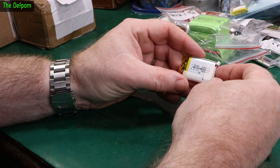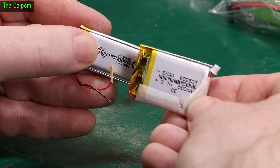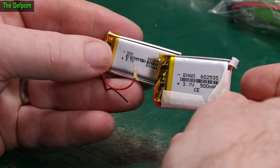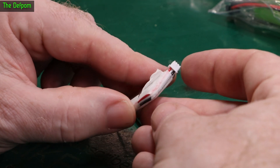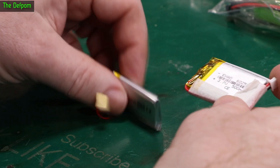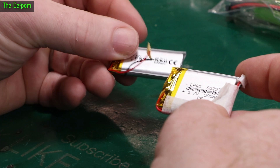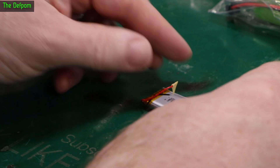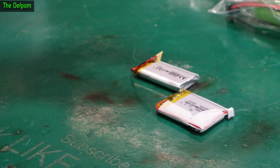There's another battery — also 500 mAh, but a different style and different size. This one's got the plug on it. So the first one has dimensions 60 by 20 by 40, and this one is 60 by 25 by 35 — different dimensions. It's good to see which one will fit best in the unit. I actually have two dash cams which are exactly the same. The other one hasn't died yet, but I'm thinking if one is gone, the other could be soon since they're the same age. This one with the plug may be suitable anyway — I may be able to just plug it straight in or adapt it. The other one I'll have to solder the wires onto the existing wiring. But this one has the thermistor connection, which is the preference. So this is the better one to use, but I've got both in case I couldn't get either one to work.